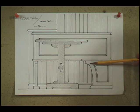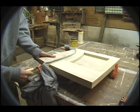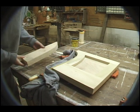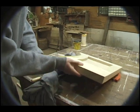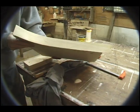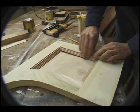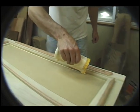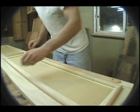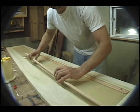The front edges of the legs were curved backwards to allow easy access behind the table. Because the two outside legs were most readily seen, we chose to panel them. They consisted of a hardwood frame glued to a plywood backing to create the panels. We glued an eighth-of-an-inch strip of wood to cover the front curved edge where the laminated surfaces met. Molding was mitered and glued to the inside corners and tacked in place. The panel backs were fabricated in the same manner — hardwood glued to a plywood backing to create long rectangular panels, with molding cut to length, glued, and tacked into position.